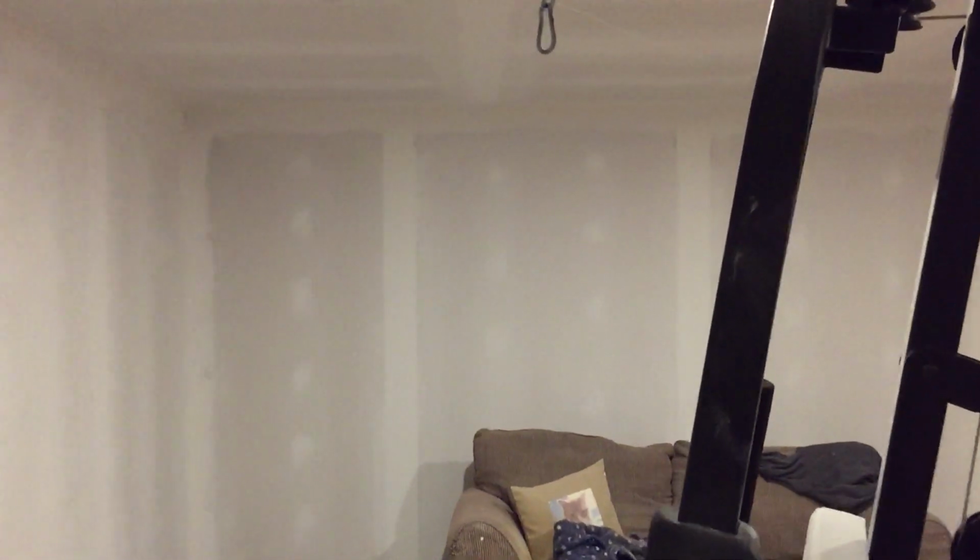But what I like to do is sometimes I'll kill the lights so that you get different views of the actual drywall, because you'll find different marks, scratches, imperfections. And I don't care who you are, how long you've been doing this for, you will always find spots that you either missed sanding or you didn't apply enough mud, applied too much mud and didn't sand it, etc. I don't care how good you are, how long you've been doing it. Some are better than others at hiding their mistakes and fixing things, but it's just life, you know? We're human beings, we make mistakes.